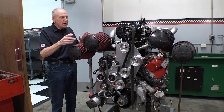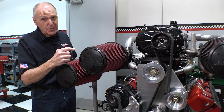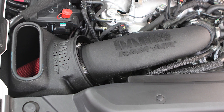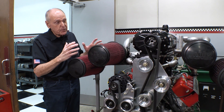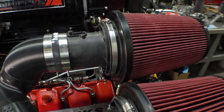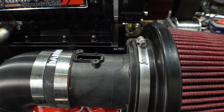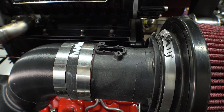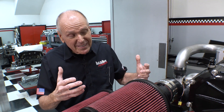You're probably wondering what's with the four big filters. These are the same filters you get in a Banks Ram Air System for an L5P GM pickup. We're using four of them because we have four MAF sensors for mass airflow. Our 4-inch MAF sensor has a 6-inch inlet bell-mouth down to 4 inches, and they flow about 62 to 65 pounds of air per minute per MAF sensor.